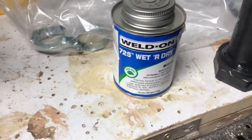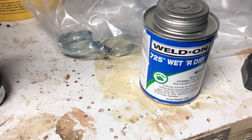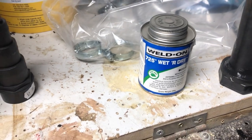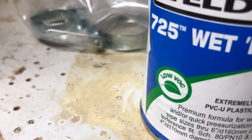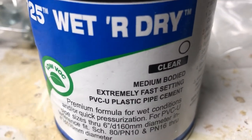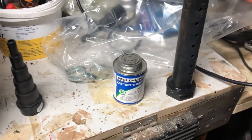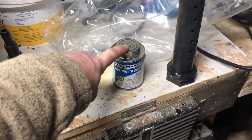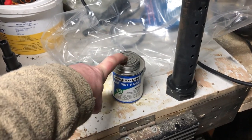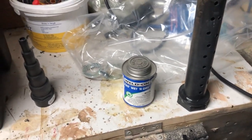For those interested, this is the solvent I use. I have moaned about it in the past, but I've moaned about it because it's actually very good — it's medium-bodied, like a fine wine. Where it says 'extremely fast setting', take note of that because it is extremely fast setting. If you're going to use this on a bottom drain on your four-inch, make sure you're putting it all together before putting it in the ground — trying to use this in the ground is an absolute ball-ache.